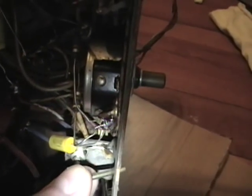Something else odd is this horizontal linearity control. Normally there would be a hole here and you would use a tuning tool to adjust the inductor inside. Well here there's actually a lever protruding which goes to this coil — to the core of this coil — and you can slide it up and down, in and out. I've never seen that before but it seems like it would work.